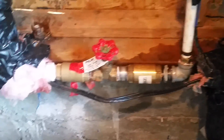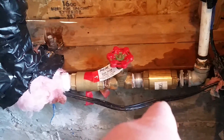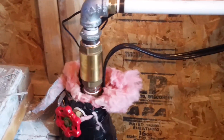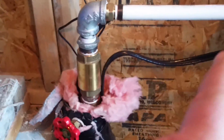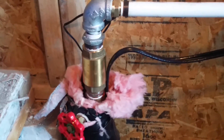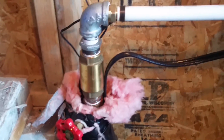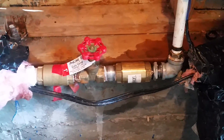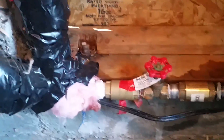There's what it looks like all done. I'm pretty sure this one-way valve was not needed — I think that's overkill. When you have a water line for irrigating or watering, you're supposed to put a one-way valve on it because the hose itself can suck air, especially if the hose is uphill. I don't think I need it here, but what the hell, they're cheap. I'm getting ready to rent the house again, so I just want to make sure that problem is taken care of.